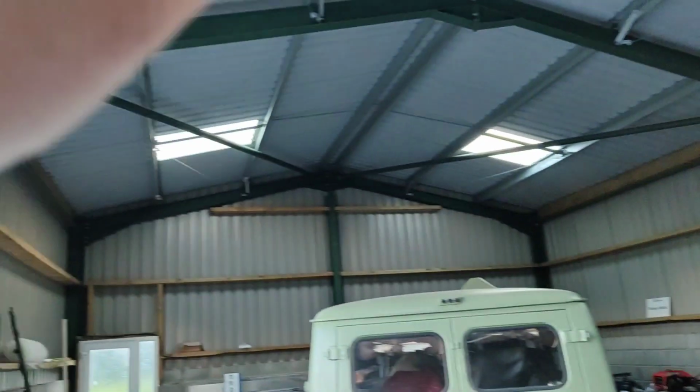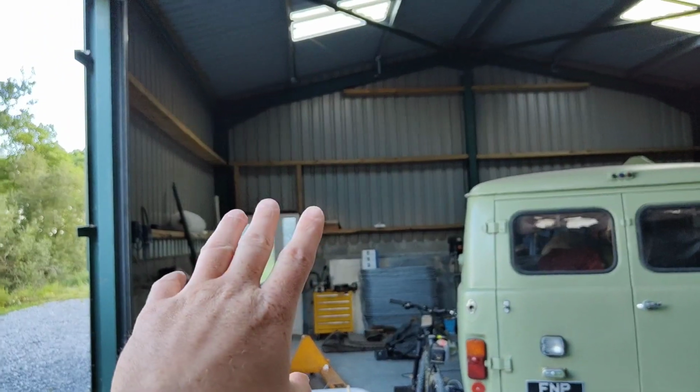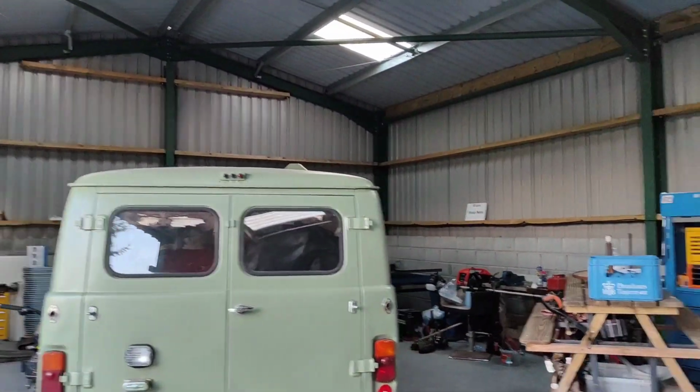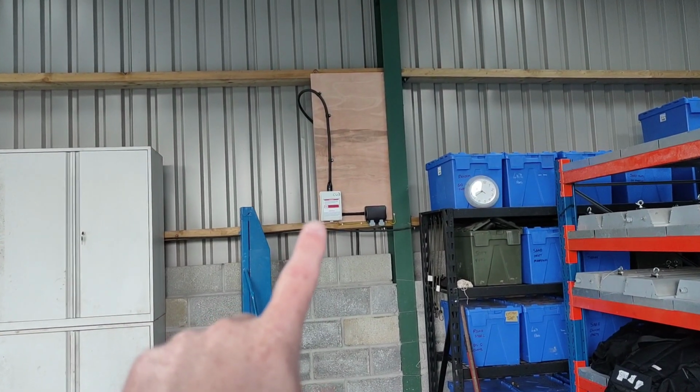And also I'll run the wire down to the door, so the switch will be on a 3-way switch. I'm probably not going to wire it to this door, just that door, 3-way switch, and that's my lighting idea. And that'll be off the 6 amp circuit breaker on that. Any issues with that? Speak now.